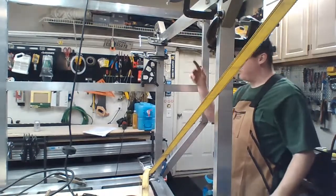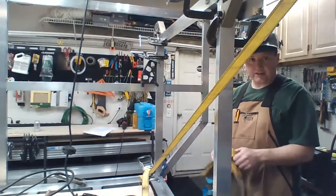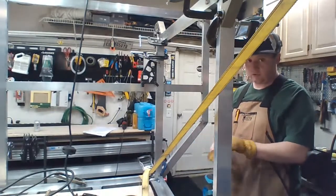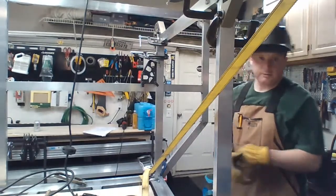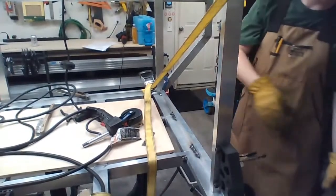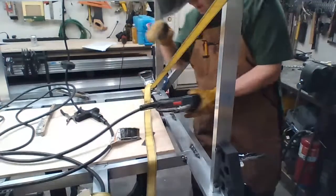And I should have brushed the weld area, but I didn't. And it's late now, so most of this has fresh cuts, so it should burn pretty well. You hear splattering, that's me trying to burn through the oxide layer, which isn't the best option, but it is an option.